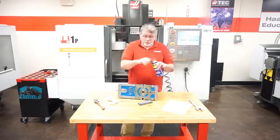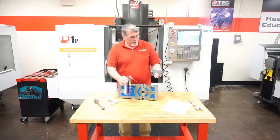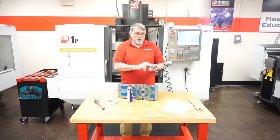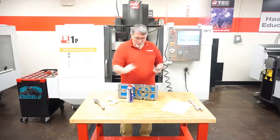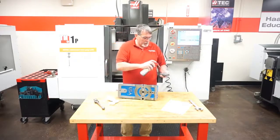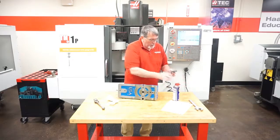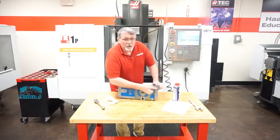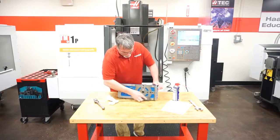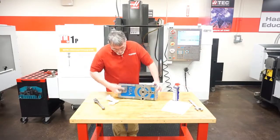Now I'm going to take a little WD-40 and I'm going to use a polishing stone. These stones have a rough side and a fine side. I'm going to use the fine side for this. Make sure that's clean. I'll just put a little bit of WD-40 on my stone. And I'm going to take the stone very gently, and I'm just going to move it in kind of a circular pattern around my vise. And you'll feel when it hits a burr, because it'll really grab.